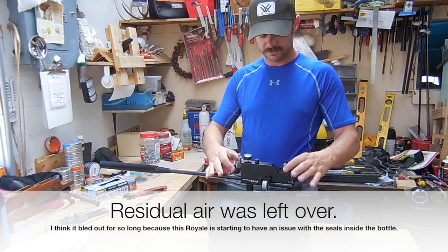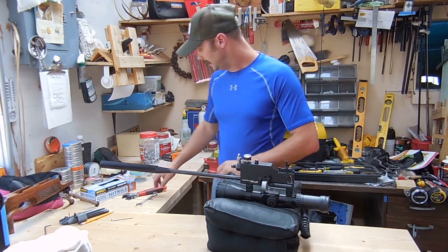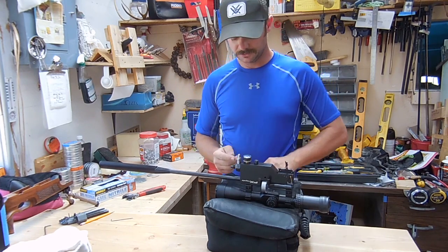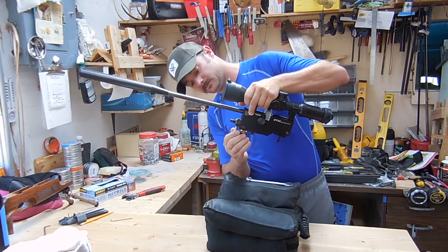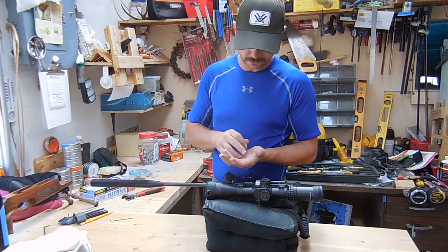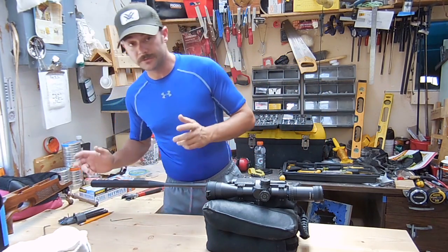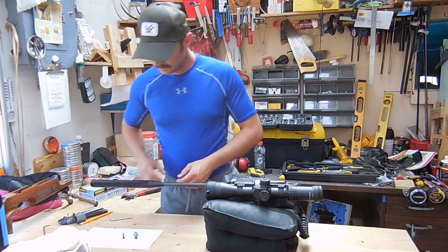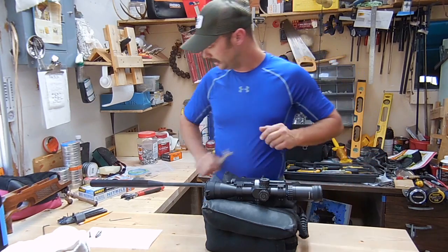What you're left with here is your breech, you've got your fill port here, and your bottle screw-on part. The next tool you're going to need is a 9/16 wrench. Loosen up your fill port almost all the way, then turn the gun over when you get to the end — otherwise your fill port plunger, this little guy, will fall out on you and you don't want it running away. Also, make sure your bench top is clean — maybe even put your parts on a paper towel as you go along to keep things in order.